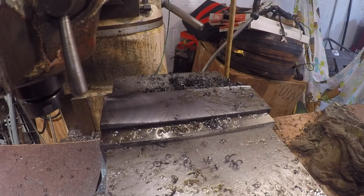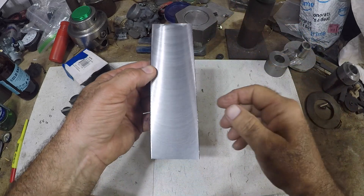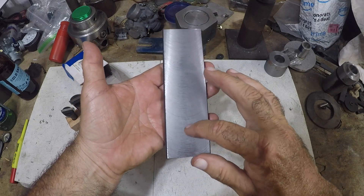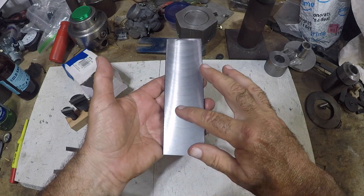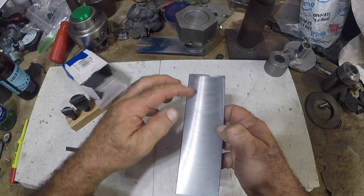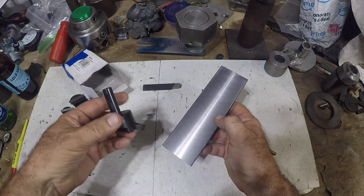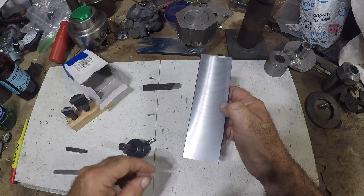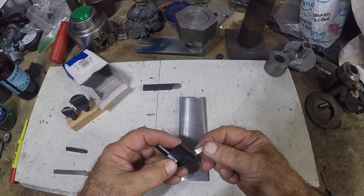That went really well. I think this was the first one — I hand fed this one so it isn't as smooth. This one I used the power feed. I'm thinking that's where it went off, or it was ending — it was cutting in this direction. The cutter isn't centered, I don't know if that made a difference, but I sure am happy with that finish. The cutter is a little dark and probably needs sharpened again.